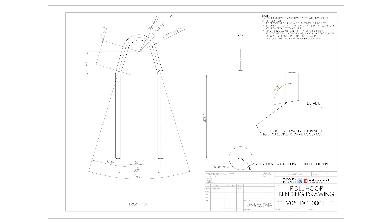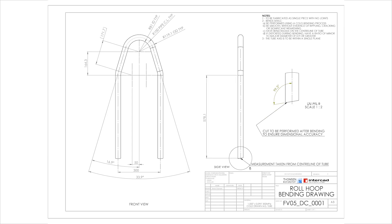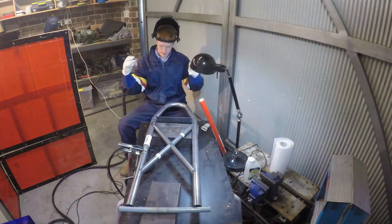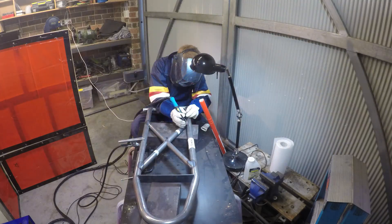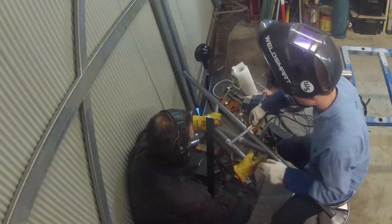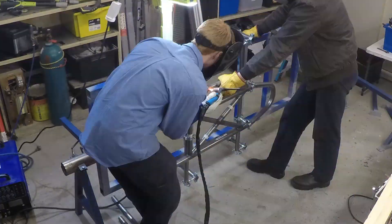I provided a drawing which included the wording from the rules on bending the roll hoop, which I also used to check the quality of the work afterwards. The results were fantastic — it was within one or two millimetres of being perfect. The first members to go in were the ones between the legs of the roll hoop. We began by tacking them in place, and after double checking everything fit correctly, the welds were completed. We built some of the side members separately since this was a lot easier than doing it with the roll hoop assembly in place. These were then welded on one side at a time to complete the car's main bulkhead.